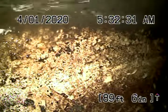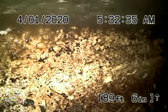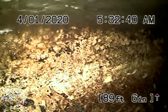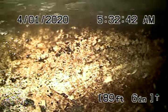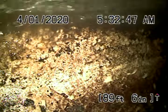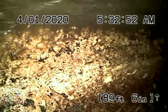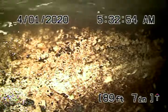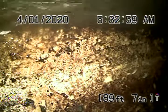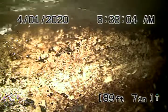Alright, so we're here at 8461 Kirkwood Avenue in Los Angeles, 90046. We tried to put our camera in from a roof vent because we always like to run our cameras through the roof vents, but the one for the middle bathroom wouldn't allow us to go in at a 90-degree turn. So what we're doing is actually running the camera from a pipe right at the back of the house — it was the clean-out for the bathroom at the back, which somebody kind of extended and made into a washing machine drain.